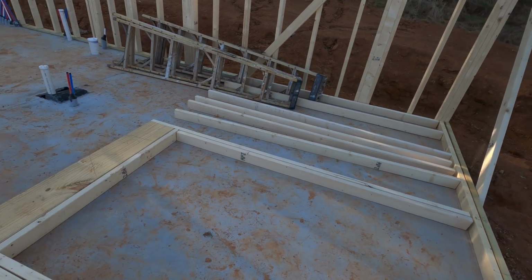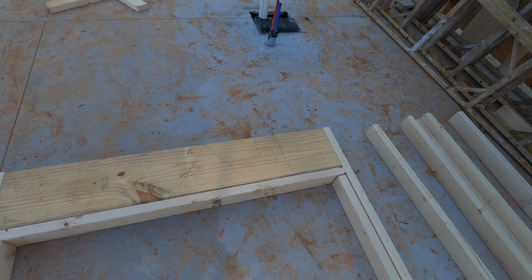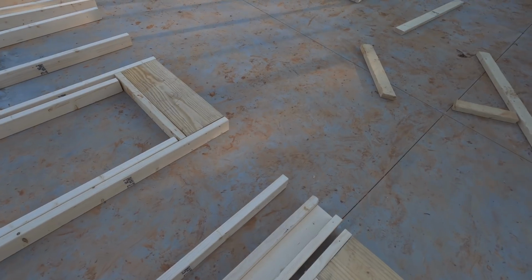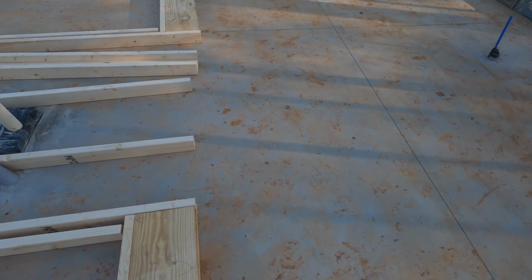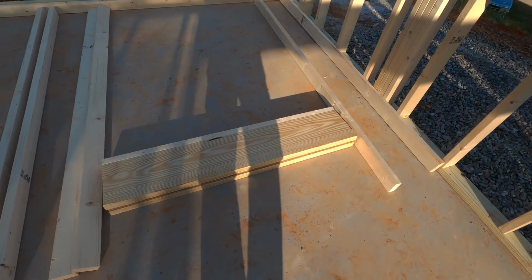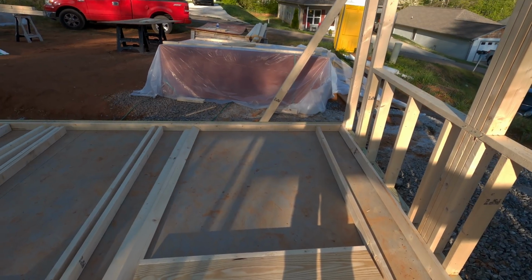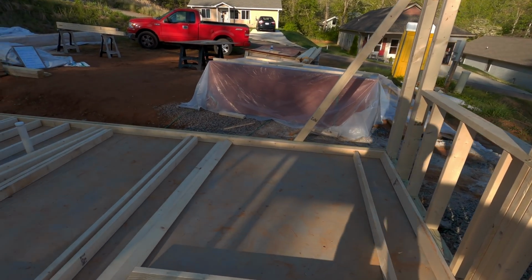And that bedroom is going to have a big window, 4 feet by 4 feet, so a 4040 with that nice big header above it. And next to it, you're going to see another header, and that's for the bathroom window for the other bathroom. That window is 2 by 3, by the way. And here's another window so you can see who's pulling up in your driveway, and that's going to be 4 feet by 4 feet, and there's a door to the right of it or left of it, depends how you look at it. So that's my baby taking shape.